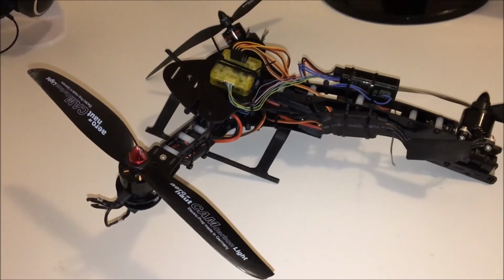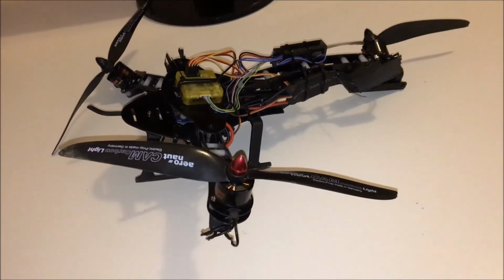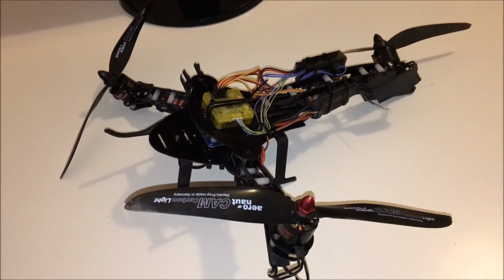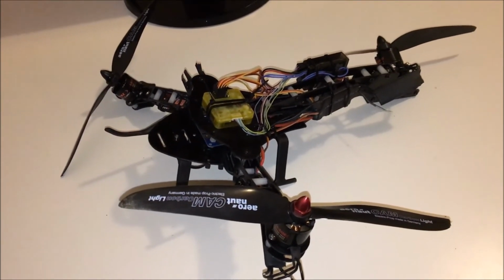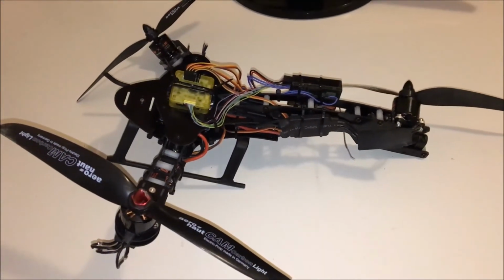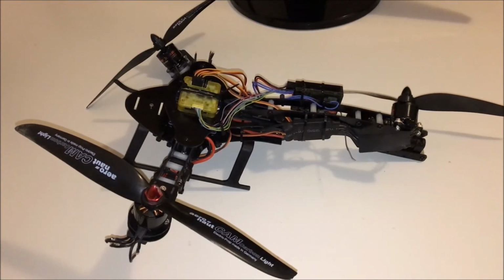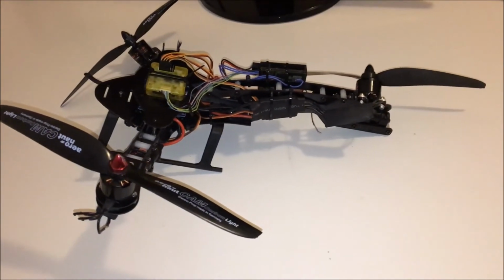that there are these problems with the tail rotor, and you can fix the wobbling, but I just want to tell you why I crashed, and the reason is, like I mentioned, the connection between the mount and the servo got lost. So think about it twice, maybe go for a quad. I personally will switch to a quad in the future, so maybe to get started in the whole drone business, maybe you should go for a quad instead.